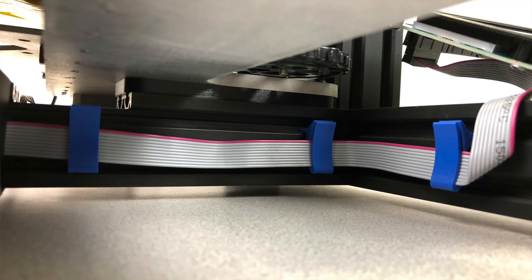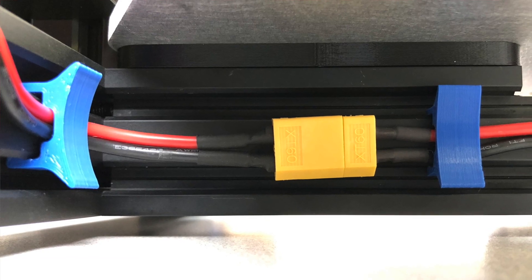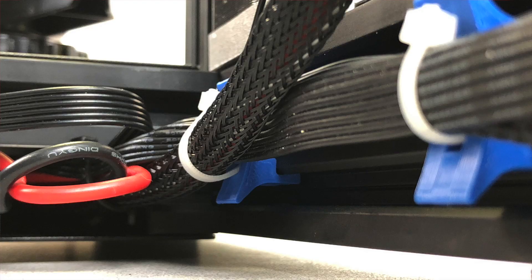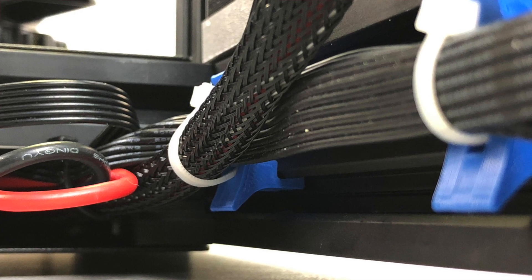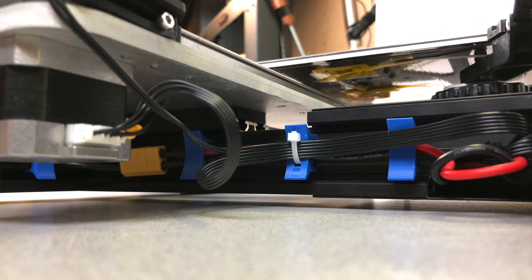The three with the ribbon cable clip will go on the front — two keep the ribbon cable close to the crossmember, and one keeps it close to the right side of the frame. Around back, use one of the power cable clips on the side with the power supply, and then use the other two to keep the power cables attached to the crossmember. Finally, you can use two of the zip tie-enabled clips on the electronics side of the printer to keep the mesh cable bundles under control, and use the last one to keep the Y-axis stepper motor cable and end-stop switch attached to the crossmember. So once you download this one, you can print, clip, and zip tie your printer's cables in a neat manner.